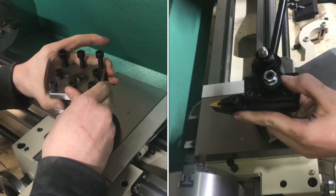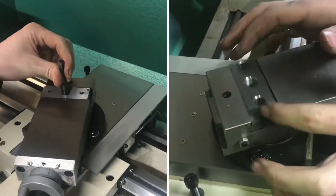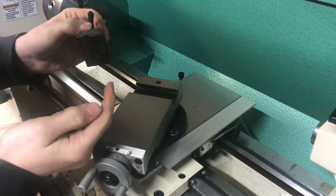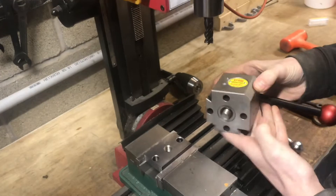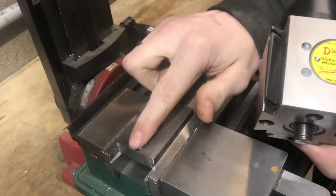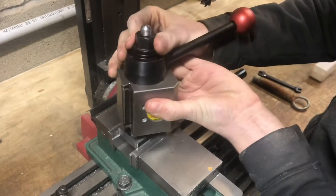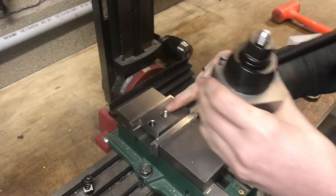It's not quite as simple as just buying a quick change tool post and slapping it on here. The tool post is what centers everything, and then there's a t-nut that goes inside the compound slide. We're going to need to make a new one to fit the new quick change tool post. The new t-nut it comes with is really just a piece of stock — it has precision holes that line up with the holes on the tool post so you can put pins in to lock it in place. This threads into the center hole and goes into the t-slot, so we need to machine it to fit.